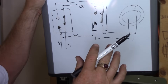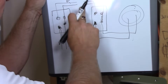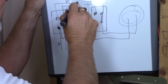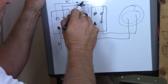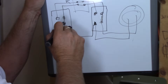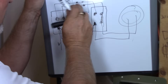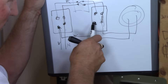If you want to add a four-way switch, it's quite simple — the four-way just goes in the middle of this circuit. You bring a three-wire out of the first switch box into another box, and then another three-wire out to the far switch. The four-way switch has four terminals. In one position it connects like this; in the other position it crosses like this. If power is feeding on through the three-way and this four-way switch is in the correct position, the light is on. Turning any one of these switches breaks the circuit and the light goes off.